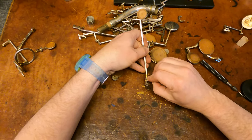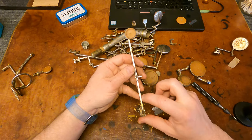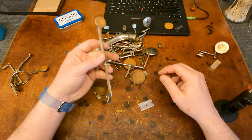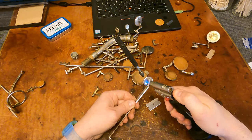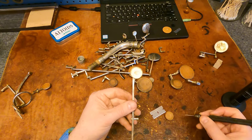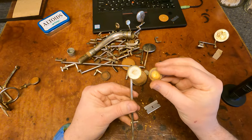The area that I'm going to be covering back up with cork needs to be pretty clean, and I think the surface needs to be a little bit roughed. Different adhesives act different, but it seems to me like it's better to have a slight bit of rough surface where you want things to adhere if you want them to stay. A lot of times on original horns, if you're taking off the materials, you'll see that they do actually rough it up prior to putting things on. It's an interesting adhesive someone was using.